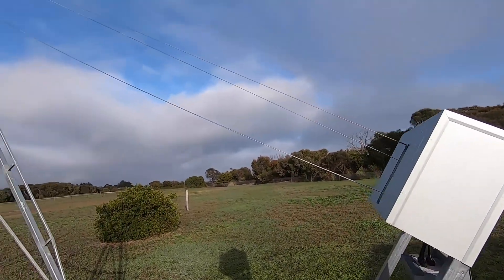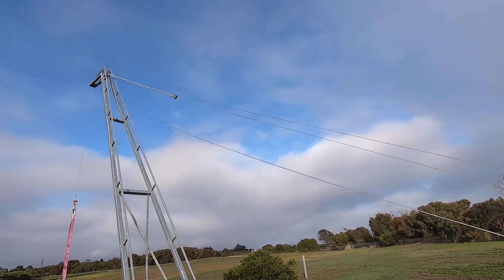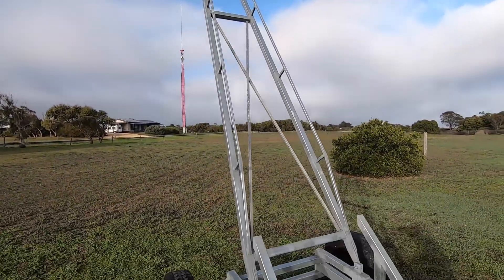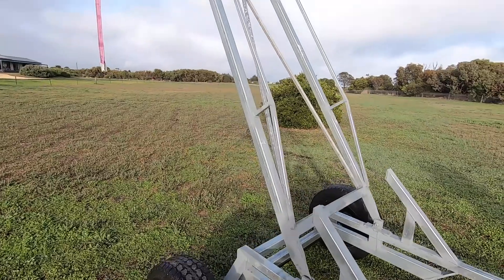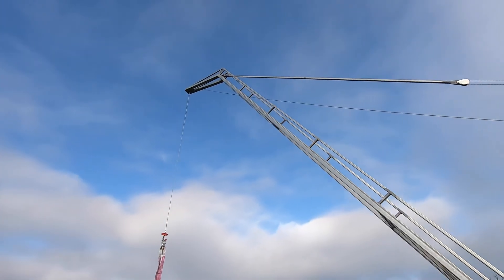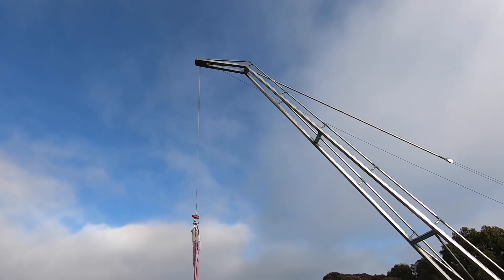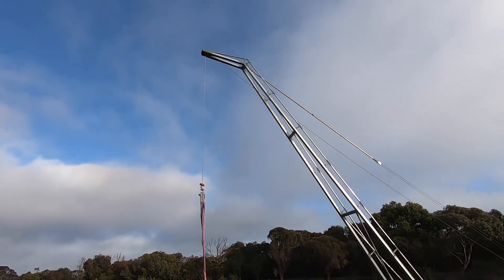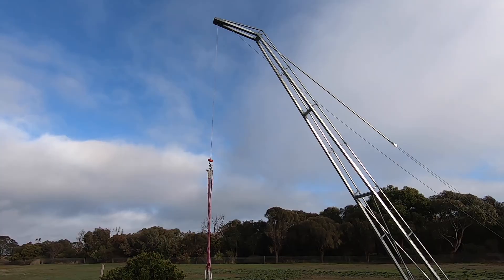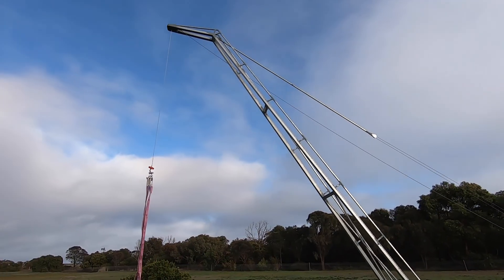There are two cables: one main lifting cable supported by the main boom, and a second winch cable that raises and lowers the boom. The boom is a triangle design, cross-braced for rigidity — RHS with rib bracing running all the way up. At the top of the boom I've added a dog-leg to give extra reach without needing extra height. At seven and a half meters at full extension, that dog-leg lets me safely reach over the top of the tiny house into the center of it, allowing for lifting straps while still maintaining clearance from the side walls.